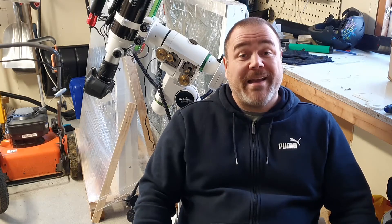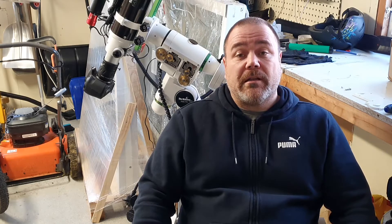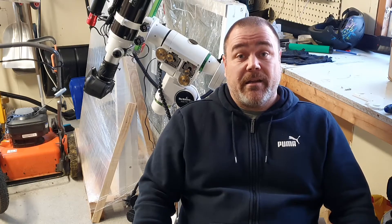My name is Morten and this is my journey into photographing the stars and deep sky objects. In this video I'm going to follow up my video on adjusting the backlash on the worm drive carrier of the HEQ5 Pro mount. We are going to check for any misalignment and backlash occurring inside the gearbox. Backlash between the worm drive and the worm gear, and the stepper motor gear and the middle gear, will all contribute to bad performance, bad tracking and bad guiding with your mount.